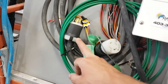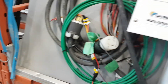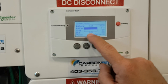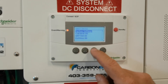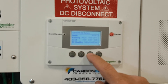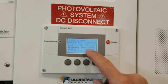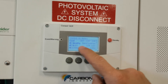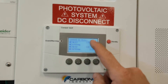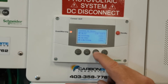I did put a ground wire here to hook up your ground plate or ground rod — so it's earth grounded, keep it safe. Here's your plug-in that'll go to your cabin. This will plug into your generator — if you need to change it to a different plug we can talk you through that. As soon as a generator is plugged in, it's going to show up on here saying 'AC In,' telling the voltage. When you go to Meters on the inverter and go into the inverter meters, you can see battery voltage, temperature, load, AC qualify, and if no power, it shows nothing.